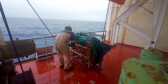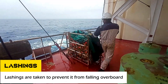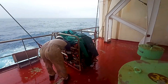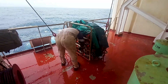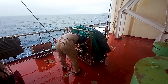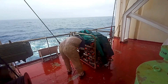The first thing he is doing is opening the lashings. These lashings were taken to prevent the embarkation ladder from falling overboard in case of heavy weather. It won't go completely because we have thimbles tied down with shackles, but even if it falls overboard, it might get damaged due to heavy rolling and pitching.